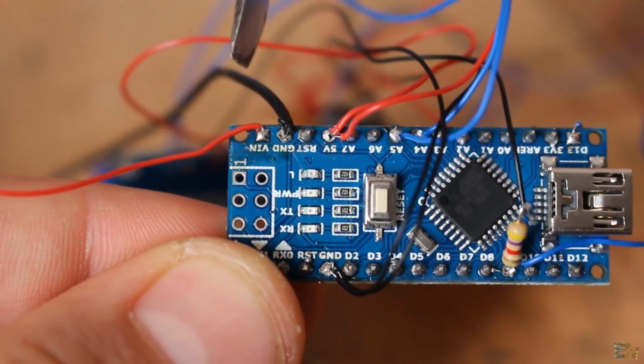Download the Texas Instruments studio. I think there is a free version for students. And then just start using C or C++, start playing with the ports, just turn on an LED and then start from there. So any tip? Well, just get into a project. If you are into a project, you will find a lot of problems, and solving those problems will teach you how to use the microcontrollers.